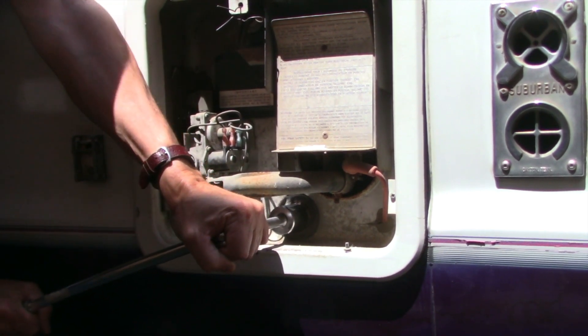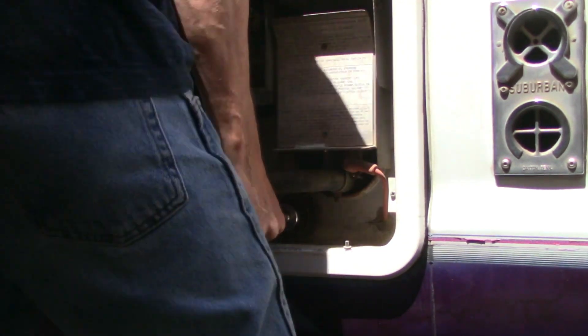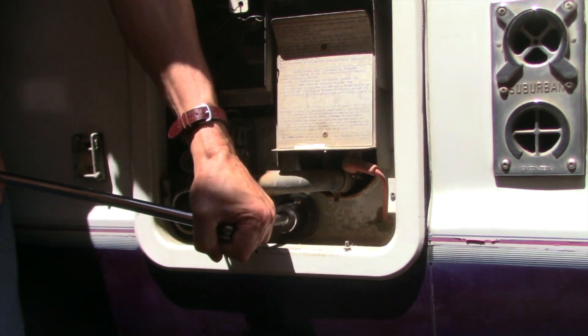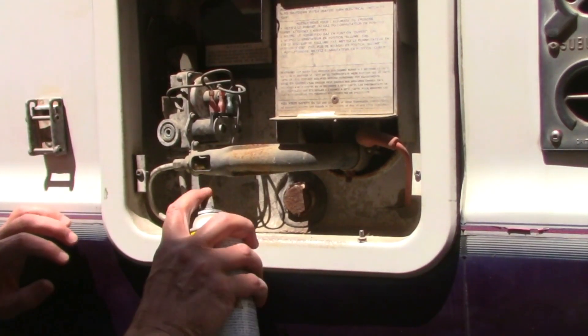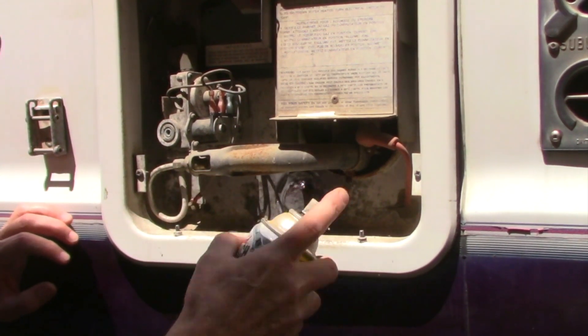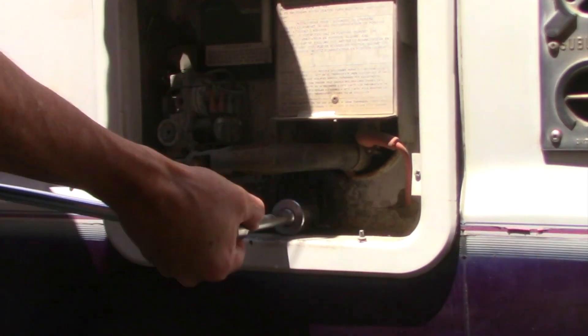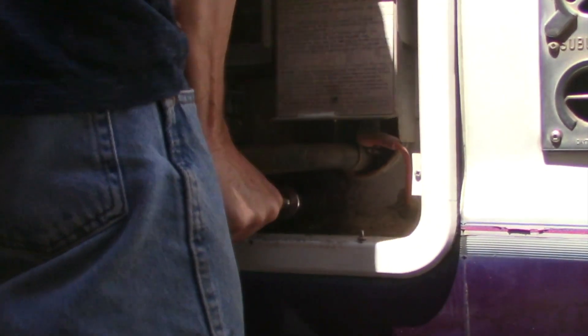And if it's really stuck, well, then we'll go on to the next step. I'm going to spray some penetrating oil in here — the longer this can soak, the better. I'm going to try working the bolt to the left, and then try working it to the right to see if I can get any slack at all. I know it seems counterintuitive to go to the right, but I'm trying to break it free, and once I get it free then I can unscrew it.